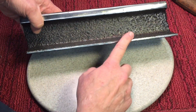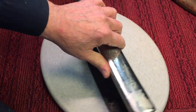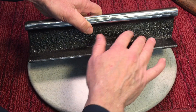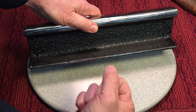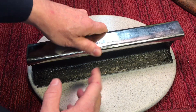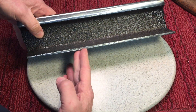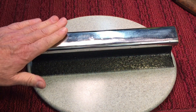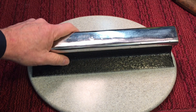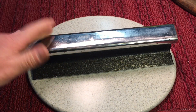Besides polishing the top and side, I took the rust off the best I could with the wire brush, then treated it with muriatic acid — one part muriatic acid to three parts water. Wipe it down, let it sit for fifteen minutes, and it turns to a dull gray, which converts the rust and seals it up. Then rinse with hot water for ten minutes to make sure it's all off, and after it dries, paint it and put it in the furnace for a couple days. A longer portable anvil is good because you can clamp it down. The two basic things you need for any portable anvil are mass and hardness.